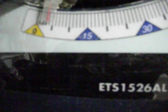You also need to set it to 7 degrees or 4 degrees — it's at 4 degrees at the moment. This is a hexagon and they are all bevelled to 7 degrees in here. And then this is the pentagon back here, and this is bevelled to 4 degrees where they connect together.